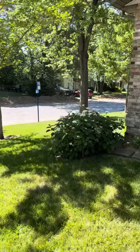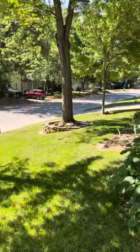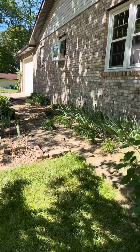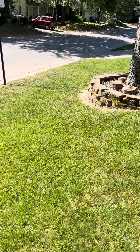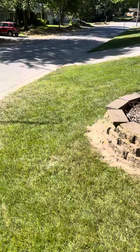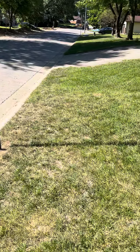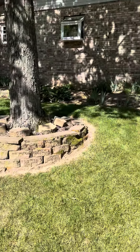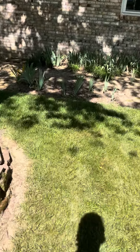Another option: if you go around the corner here, he's thinking about taking out that tree right there — the middle big one, not the little ones on either side. We can get into the house over here into the basement. I don't know if you could back the rig up and drill. There is a sewer line — you can see the manhole — it runs right along here. Maybe if we can back the rig up just beyond that and drill on this side of it, get rid of this tree, and go into the house.